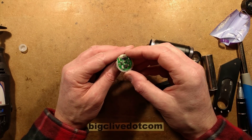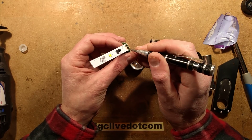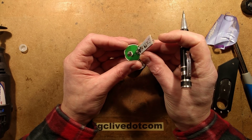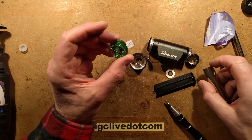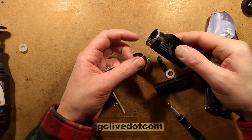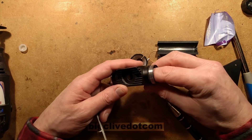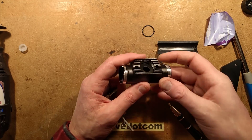There's nothing super obvious, but there is one connection - a sooty connection from the USB port here. There's a slightly burnt connector down there, and it looks as though it may have actually been a factor. I don't like the fact that in this design, when you put a battery in, it makes a connection onto the outside plate. It would have been nice to have some indication of which way the battery went in, apart from the one that doesn't produce smoke. I'm pretty sure that when I first got this I put the battery in the wrong way around - let's test that.